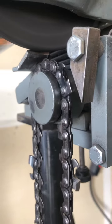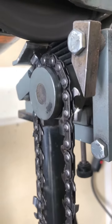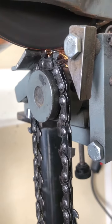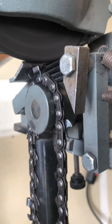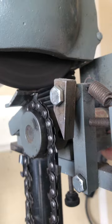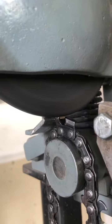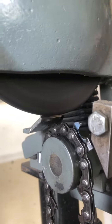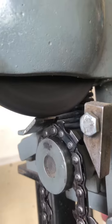Just barely kissing the rakers, and putting them on the raker grinder, which really puts a nice, even grind. It makes them absolutely all identical. So I think you'll like the way it runs. It should be nice and smooth and super straight.